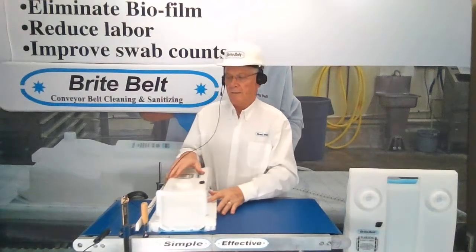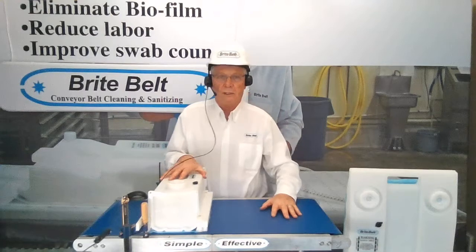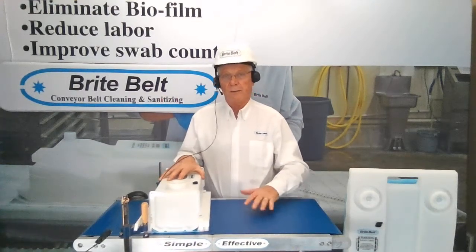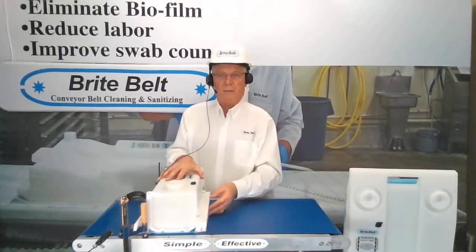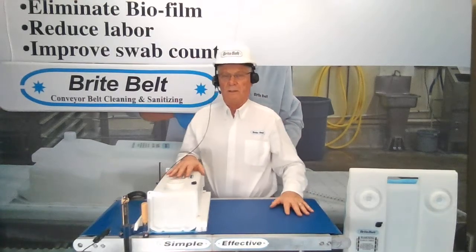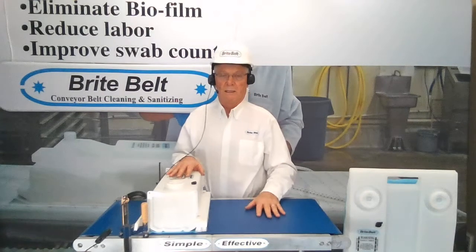There are four parameters of cleaning. There is time, action, concentration, and temperature. The time is the window of opportunity to clean, which is sometimes limited, but with a non-abrasive pad, you can leave the scrubber on the conveyor for as many revolutions as necessary to remove the biofilm.